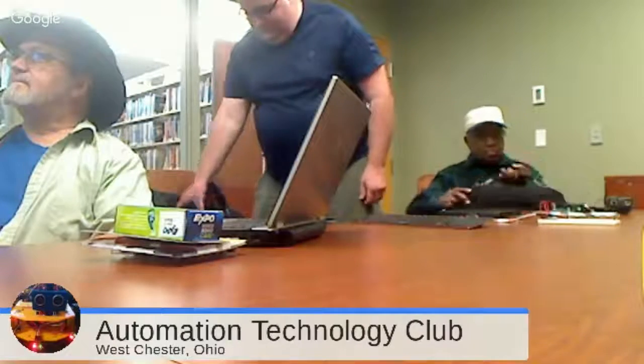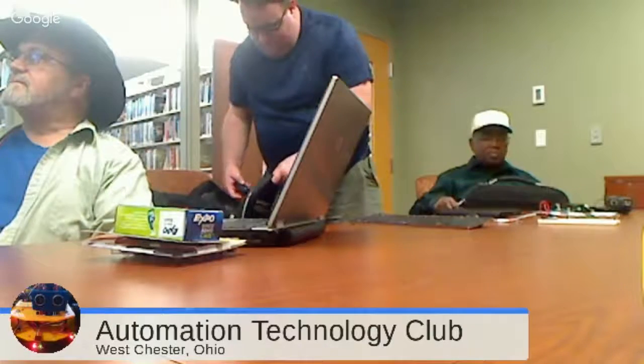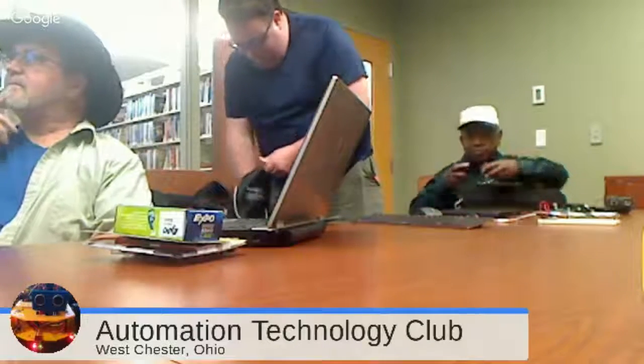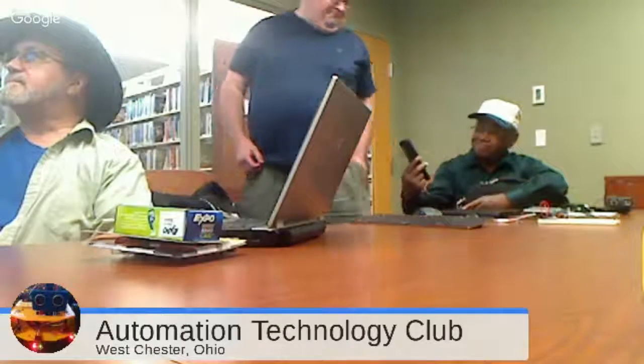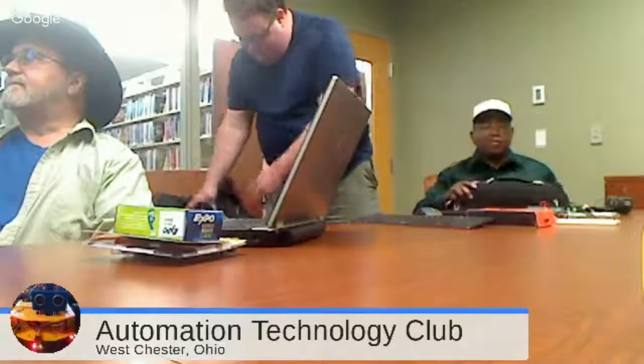T would be the time, how long you want those to run. Previous T would be equal to mils, actually, to start with, it would be set to 0. And then once it runs through one session, it gets set back to mils again. And you just keep checking that over and over again, and you do something inside of this loop.